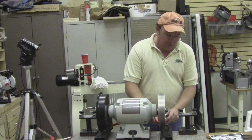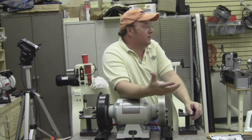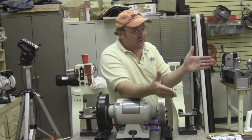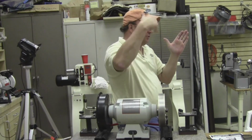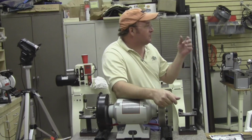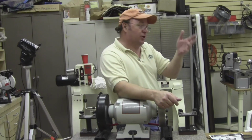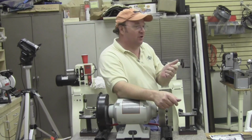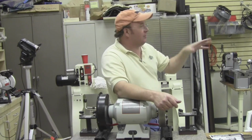Now, talking about bowl gouge angles, and I've seen a lot of different things. The more traditional swept bowl gouge with a wing on it ranges from about 50 to 65 degrees. The steeper nose angle allows you, when you're turning bowls, to get deeper into the bowl. Now, there's proponents of narrower ones. You look at all of the gouges that Johannes Michelsen uses. Those have a 40-degree edge, but he grinds the heel off on those. So you've got a really narrow cutting edge, and he grinds the heel off.